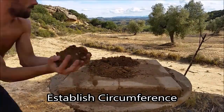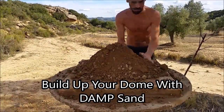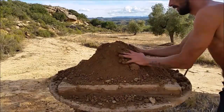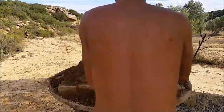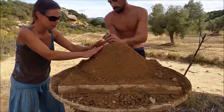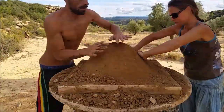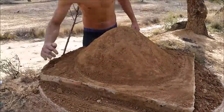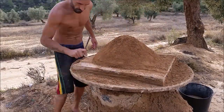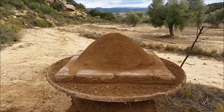What I'm doing now is working out exactly what space I'll need to accommodate the pizza tray, and then building it up with damp sand. If it's too wet it won't work — it needs to be damp. We got lucky because it rained, so the dirt was already damp enough. After you get the dome structure just right, which takes a lot of padding and pulling, you're going to want to start covering it in newspaper or any wet paper. This acts as a divide so you can later peel back that paper and clear out all the sand below, leaving the clay on the outside. I'm cleaning off the edges where I'm about to apply the first layers of clay and cob.